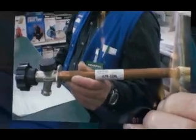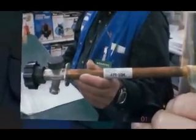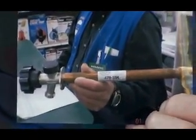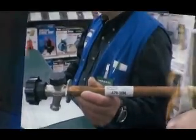If you leave your hose on that valve, what happens is you have an airlock and that can freeze up. It can break before spring — it can break at any time. So you always want to, in the fall, disconnect that hose, whatever you do.